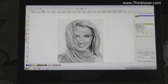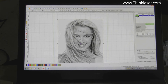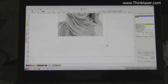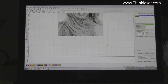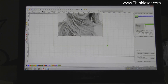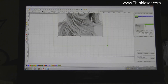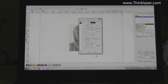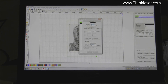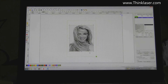We apply to source and OK. That green is just an A4 border which is not going to print - it's just so I can locate in the bottom corner. I've got my zero set down in the bottom corner and we're going to start across the bottom of the picture because I want the scanning to move up so that any fumes get drawn across the paper and the picture remains a nice clean smoke-free picture. We're going to set the speed to 50 and power down at 11%, take all the ticks away, set the resolution to 150, line interval 0.1693 to match the pixels.